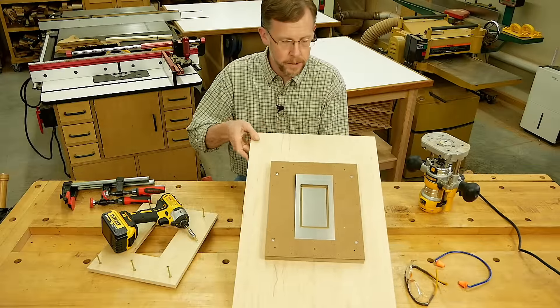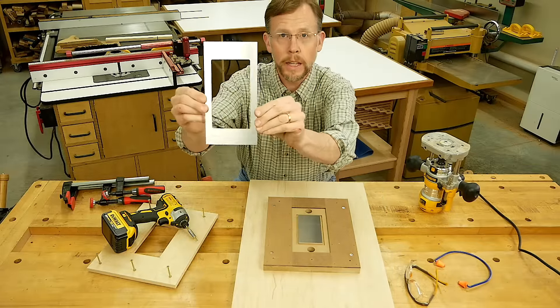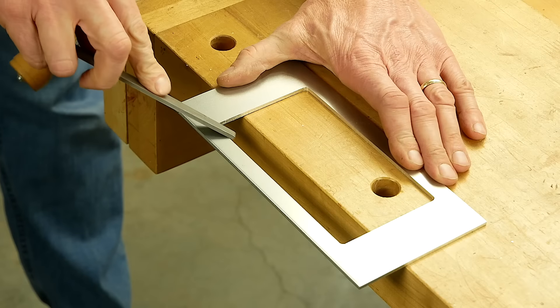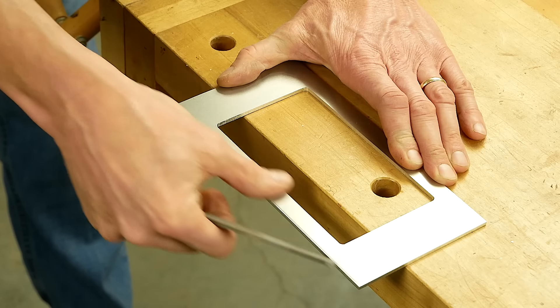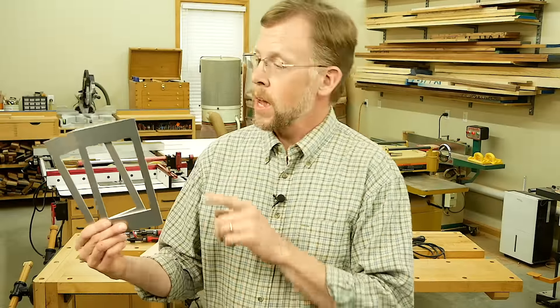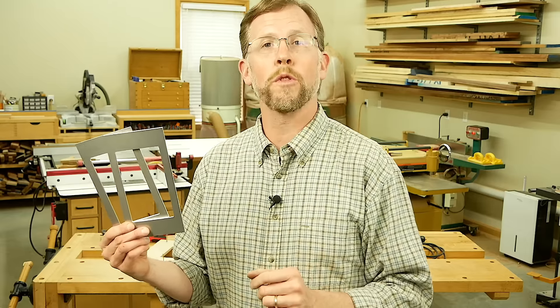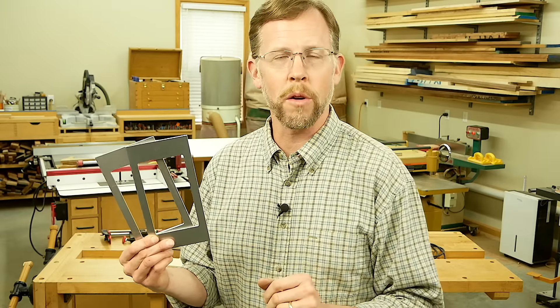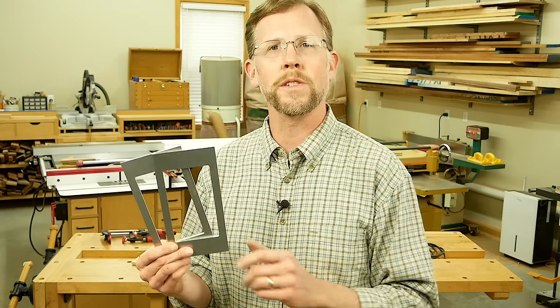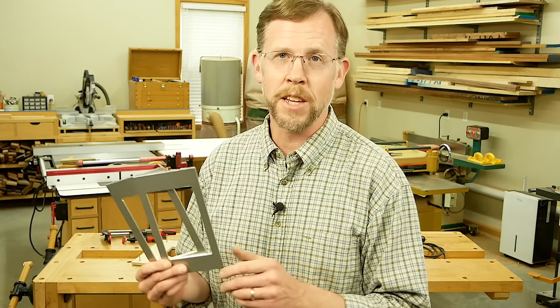What I really like about this method is how cleanly the metal gets milled — it's much smoother and straighter than you'll get with a jigsaw or hacksaw. With a little bit of filing to remove any tiny burrs, this plate is done. And despite what you might fear, routing aluminum doesn't seem to dull a router bit. I've milled several of these plates already and my router bit is just as sharp as it was before I started. So the next time you have a project that involves cutting aluminum, consider using your router — you might be surprised by how easy it is and how well it works. I'm Chris Marshall with Woodworkers Journal magazine, thanks for watching.